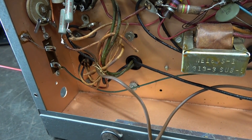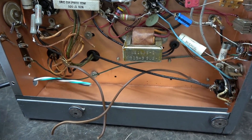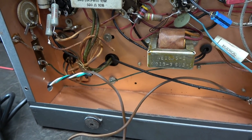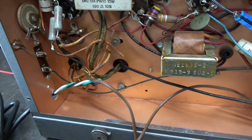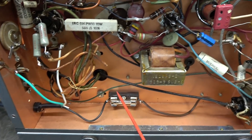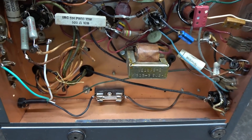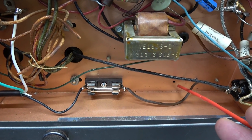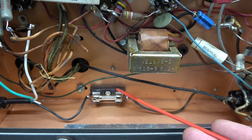While I was routing in my new power cord through the original hole, I noticed another alarming thing: this radio doesn't have a fuse — there's no fuse in here at all. So we're going to add that too as another layer of safety. It was easy to install a chassis-mount fuse holder because there was already a matching hole — a 4-40 screw went right through and it mounted up, no drilling required.